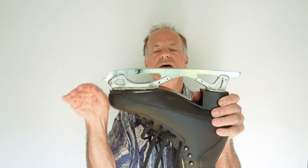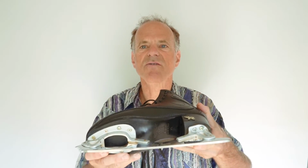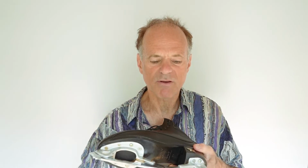The original machine was pretty good. It was a little bit flawed because of the rocker curvature of the blade. It was on two rollers with one bar down below, so the blade came closer and farther. It swung a little bit, pivoted around that axis, the support axis, and so it did create a slight bow in the sharpening levelness, and it was pretty negligible. But now he's corrected that with the double bar and double carriage system, for which I am so appreciative.